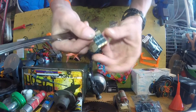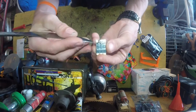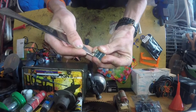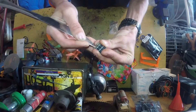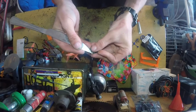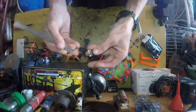There's a little coating here and you kind of want to scrape it off. When you buy these ESCs you'll see what I'm talking about. Make sure you scrape this coating off because the solder will not take properly if you don't scrape it off completely. From my experience, if you scrape it off, it'll flow right in.